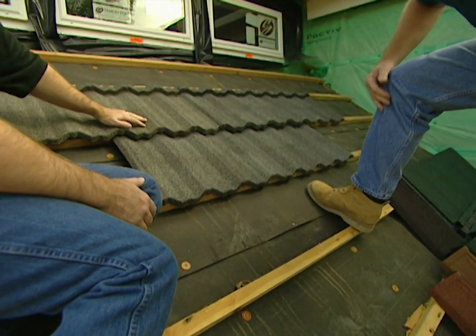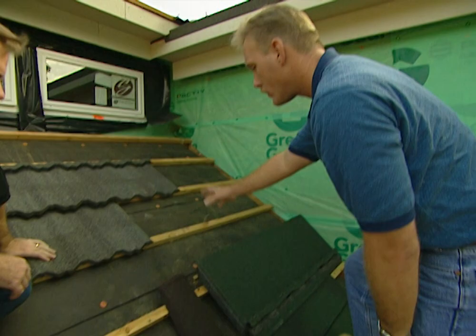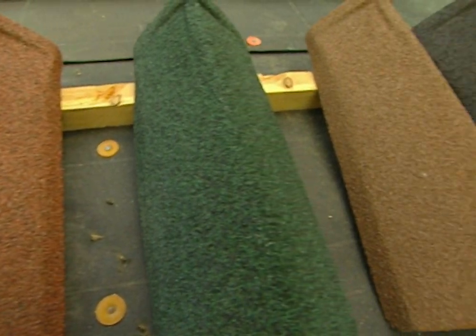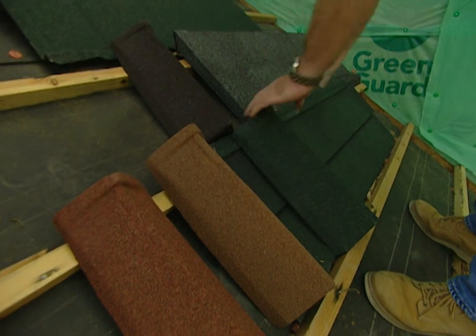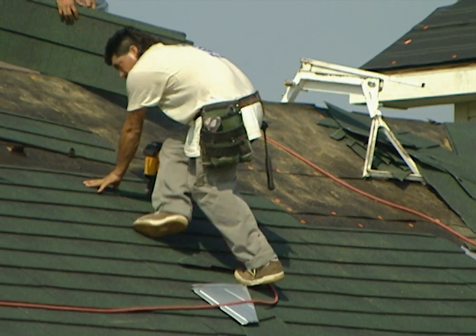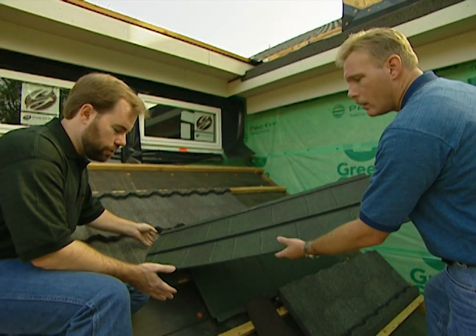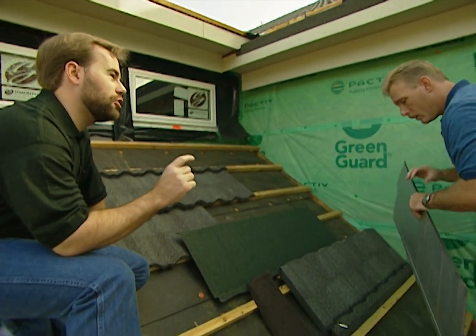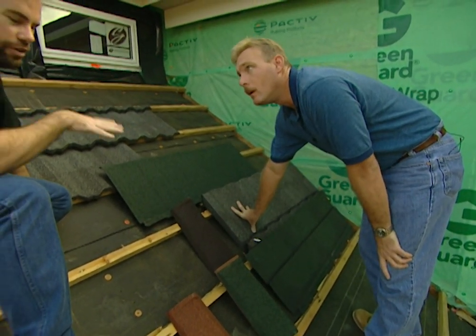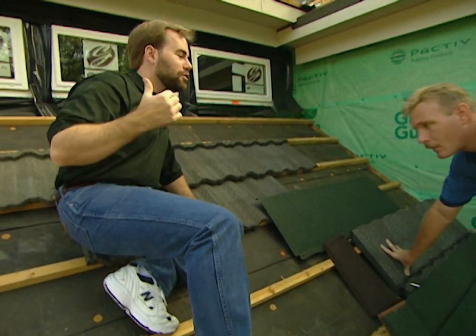One major advantage of the batten system is that it creates an air pocket between the shingle and the roof decking — a great insulator with dead air space always moving. For the valleys, ice-and-water shield plus felt paper are used, and then a custom-cut, custom-bent metal trough is placed in the valley to catch all the water running off both roof fields. For penetrations like a large metal flue, a base is connected to the deck and sealed, then a boot goes over the top with a drip cut around the bottom, sealed and stone-coated to blend in. For smaller PVC pipes, a stone-coated flashing goes to the base with sealant around the top. Ventilation is handled by a ridge vent system that allows hot attic air to escape without letting water or bugs in.